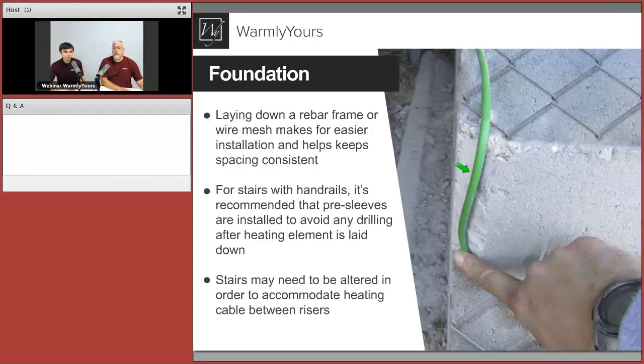And you'll really need this if you're putting a limestone cap on the front, right? Because you're either going to need to make sure you have about an inch of mortar, or you can do this relief here. Sometimes if you're doing a run and it's running across the face down to the next section and coming back, you can just take this edge off, and you don't need to worry about all that because you're just going to run it across here.